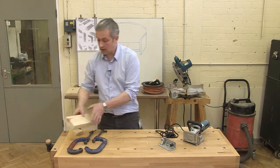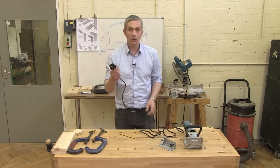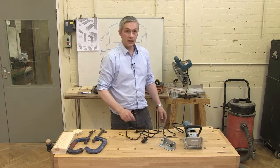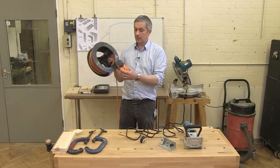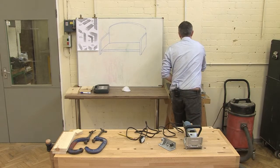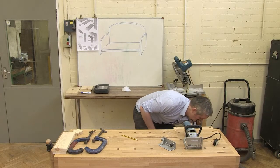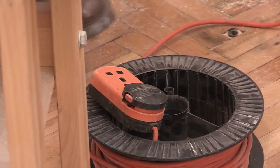This is a 240-volt biscuit jointer, which is okay in a workshop but not on a building site or anywhere outdoors — that would need to be 110-volt. In here it's fine because it's nice and dry and a relatively safe environment. I'm going to use an extension cord with a circuit breaker built in. I'll plug that in, leaving it switched off while I do the setup, and once everything's set up I'll make sure that stop button — a push stop — is nice and close so I can step on it if anything goes wrong.